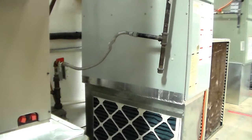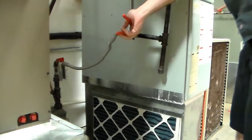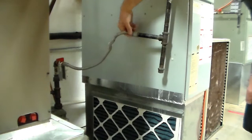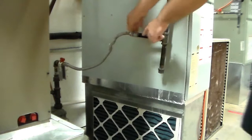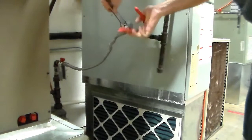You'll slowly turn on the A9 valve, then come over here and physically separate this flex or union — whatever it is you're putting on there. Physically separate it, open it up, take the flex apart, turn on your gas cock, and let that flow until you've got gas coming out. Leave it flowing while you tighten it down — that way you know you're purged all the way up to your flex.